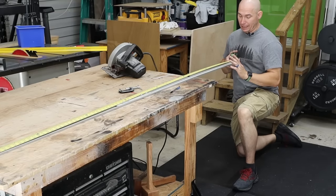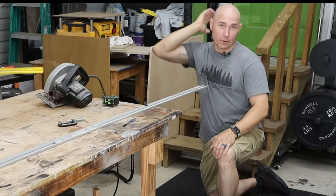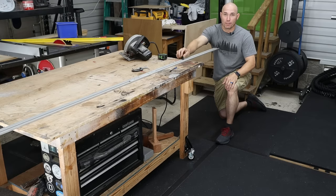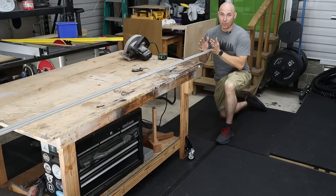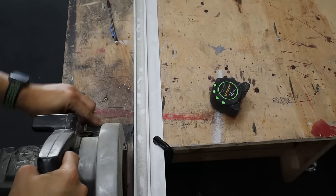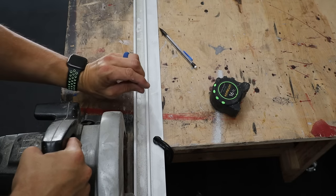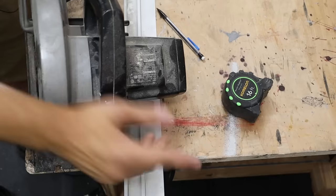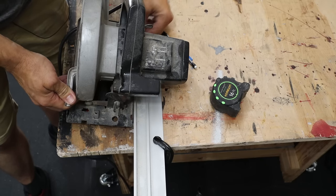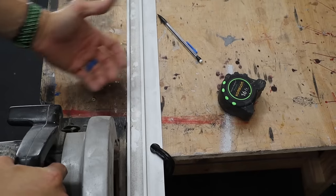It's actually eight foot four inches. What's great about that is you get two inches of overhang on each side of your plywood when ripping a long eight-foot strip, giving your saw plenty of room to keep tracking after reaching the end, and plenty of room to clamp. I highly recommend picking one of these up if you use sheet goods at all — $40, and they work excellent. Once each end is clamped and the distance measured off, your saw fits right up against it. It's about the same height as a saw shoe — a good flat surface to run against, but not so thick it interferes with the motor. This is a great way to get a good straight cut on plywood, two-by-eights, two-by-tens, and things like that. You can even use it to joint an edge of a two-by-ten.